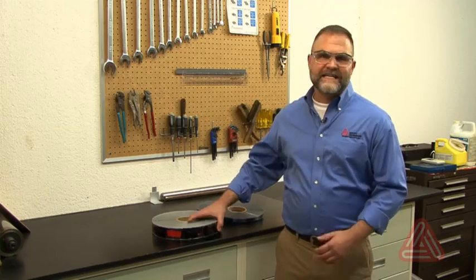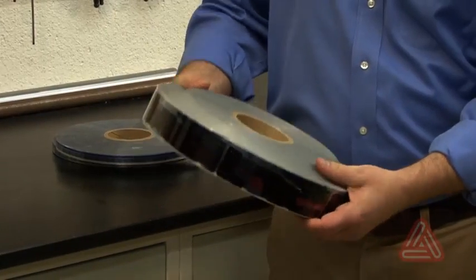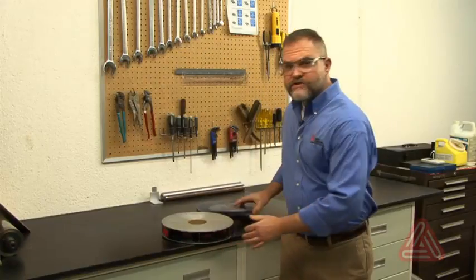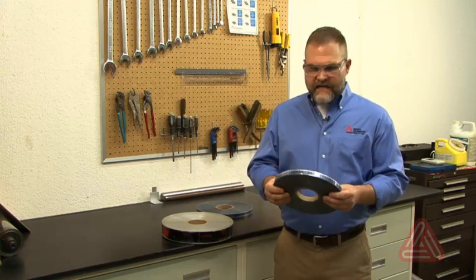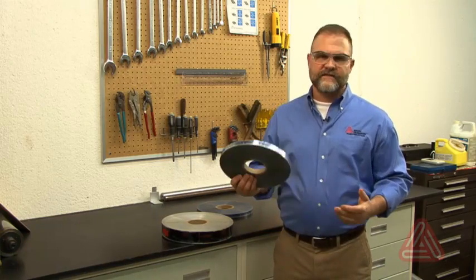You will need to experiment with the starting tension and taper settings for each job to find the ideal combination. Finished rolls should allow for easy, fluid motion of the core when pushing on the side of the roll. Rolls that are wound too tightly can cause adhesive ooze and embossing of labels inside the roll — there should be visible movement of the roll, not a rigid disc-like result.